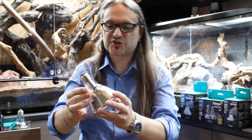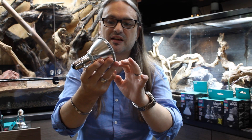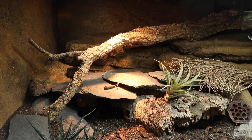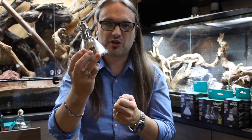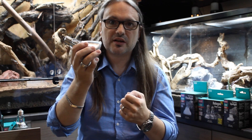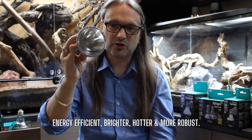When we get to halogen, you'll see we have a completely different type of lamp. These use a very thick envelope — the glass is very thick and very insulating — and a solid, either folded metal or vaporised aluminium reflector on the inside. These capture much more of the energy produced by the lamp and reflect it downwards. It's basically much better insulated with less waste. Halogen lamps use a tungsten filament within a halogen gas inside a small capsule within the lamp, and they produce more light per watt than standard tungsten lamps, making them a more energy-efficient solution. They're brighter, reach higher temperatures or higher power density readings more quickly, and tend to be a little bit more robust.